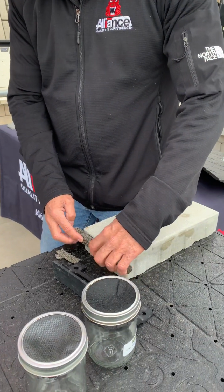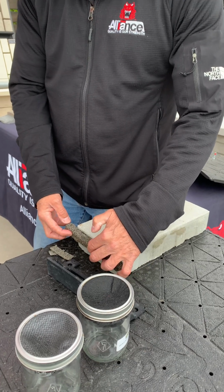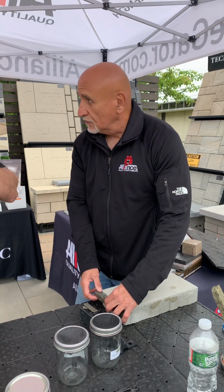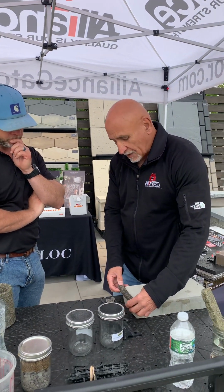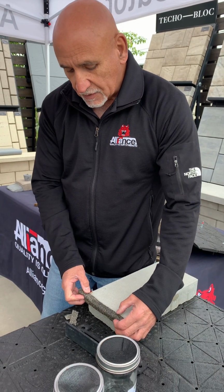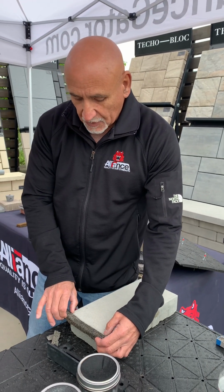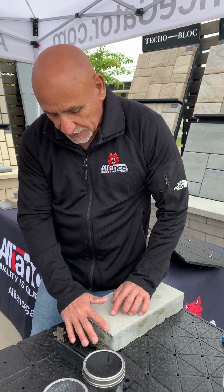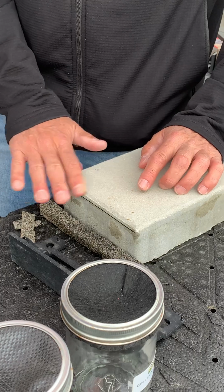But there's two reasons why it's important to keep it low. Number one is this is not a wearing surface. The paver's the wearing surface. So you want foot traffic and vehicular traffic on the paver, not on the polysand. If I have it up too high, vehicles and foot traffic are going to wear on this, and eventually it's going to come away. And then you're also creating a weak point, because when they bring it up, it's going to be laying on that chamfer, and it's kind of a feathered edge there, and it's going to be very easy to pull away there.